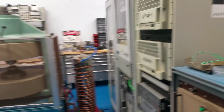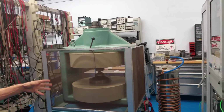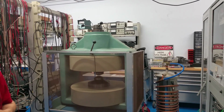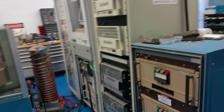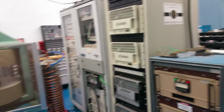Now I see why you would need liquid cores, because you're putting that kind of energy. But again, you're turning the magnetizer on and off during the process, which puts a lot of strain on it also. Okay. And you have to have three-phase power, which prevents the system from blacking out the whole district every time you go to magnetize a little layer. I understand. Okay.